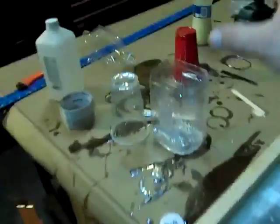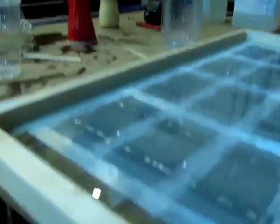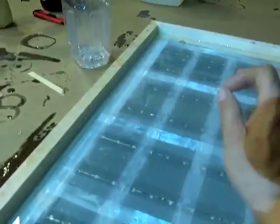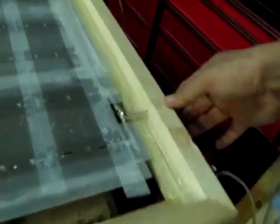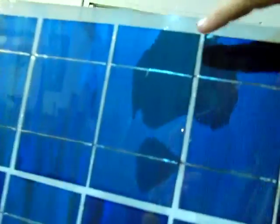That's why you want to mix your resin in one container, pour it into a second one, and mix it again with a different stir stick. I have two stirs here. This stuff, by the way, is perfect for countertops — notice there's no bubbles. If you see other people who have used the $45 can for solar panels, they have huge bubbles because that stuff has a very thick viscosity. You want to do this right before you go in for the night and let it set up overnight. You can build a small dam here with a piece of wood and pour more resin there to fill these junctions in.